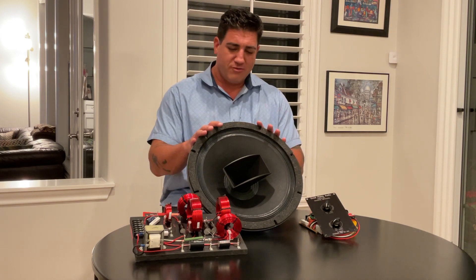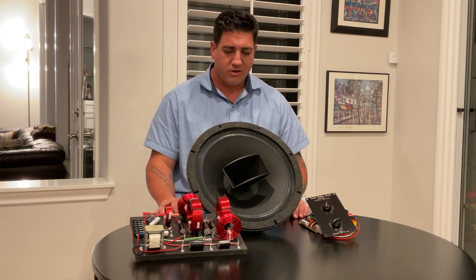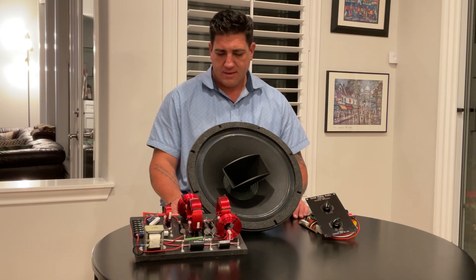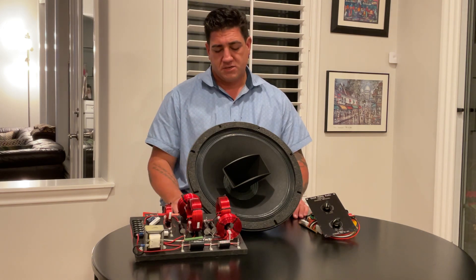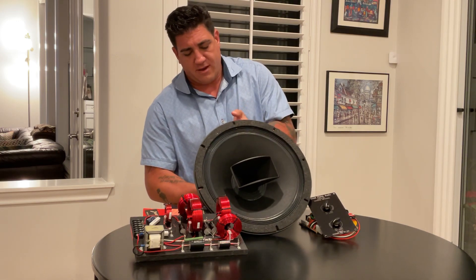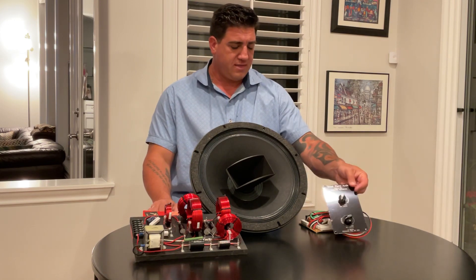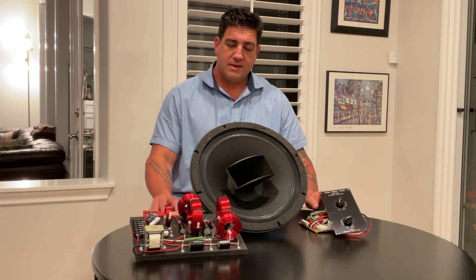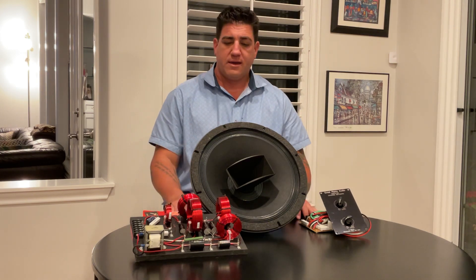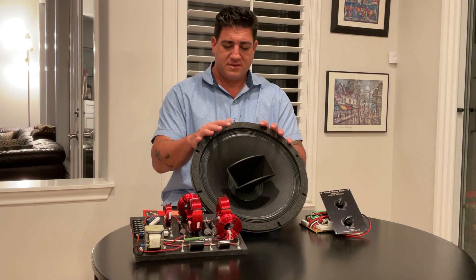What we have here is the venerable, world-famous, never-duplicated Altec 604 made by Great Plains Audio, and it is a wonderful reproduction of the original Altec 604 — just an all-around great speaker choice. We went with the Altec 604 with the ferrite magnet. The ferrite magnet is significantly shorter than the Alnico, and there is some thinking that you get better coherence and time alignment by having the voice coils closest to each other — the Alnico is like four inches longer. We're going to put that idea to the test, because the next ones are probably going to be Alnico.